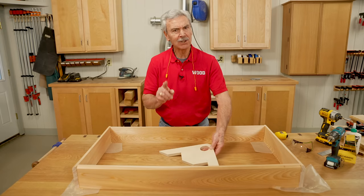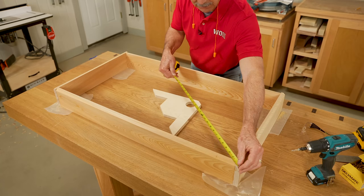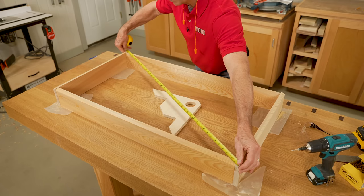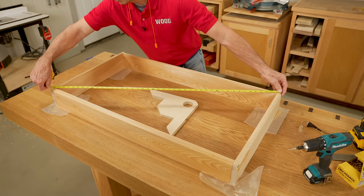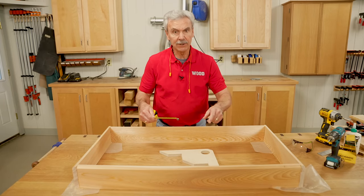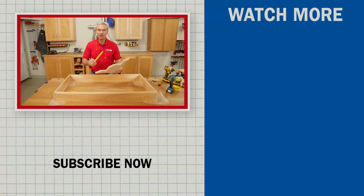But there's a way to check this another way, just to kind of see. If I take a tape measure and I measure diagonally, outside to outside is 44 and a half. And doing the same thing this way also shows 44 and a half. So I've checked the square of this two ways — one is the old fashioned angles, and the other is using this jig. It works great, so you can be pretty comfortable. This will work for you.